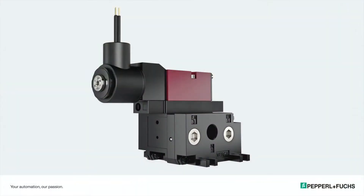The digital valve will give you the purging because that's a solenoid valve and it's activated by either the 5500 control unit or the 7500 control unit. We purge the enclosure through that digital valve by energizing the valve. After it's finished purging, the digital valve is shut off and the needle valve, which is basically in parallel with the digital valve, takes over and just keeps a low flow rate going in there so that you keep a positive pressure within the enclosure. By doing that you maintain safety within the enclosure.